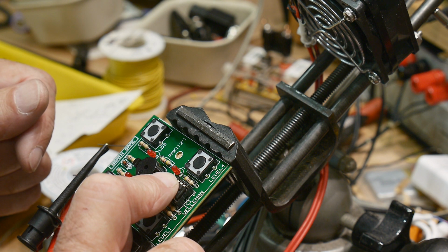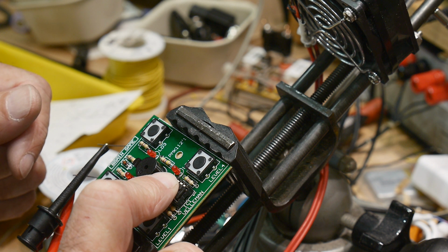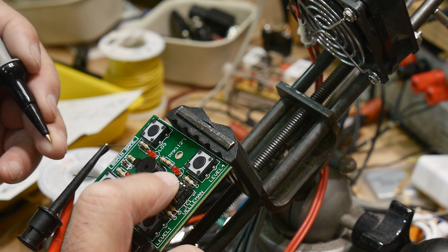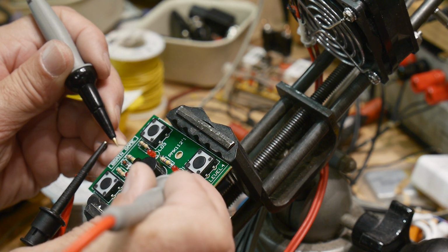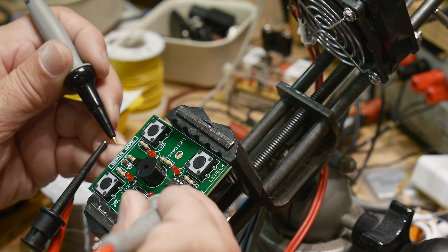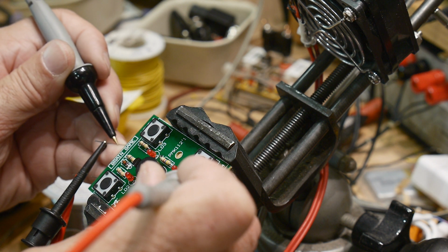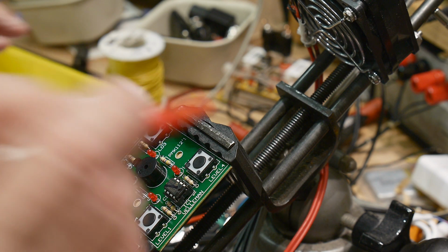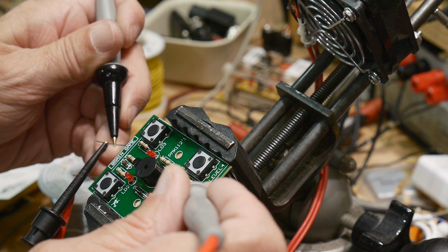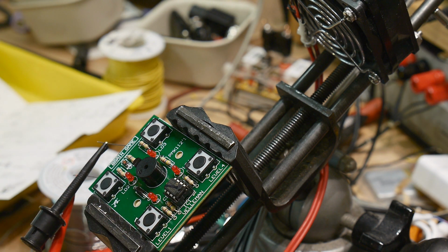Oscillator, clock in, VPP. VDD and VPP. Pin 1. 4 and 8. 4 is ground. 1 is 4. Alright, maybe it's just low in voltage? We're going through a diode drop. So we're getting 4.4 volts. Let me go up half a volt. Now we're getting 5.2 volts to the microprocessor. And it doesn't work. Fail. Maybe that mark was saying that it's bad. Oh, shoot.